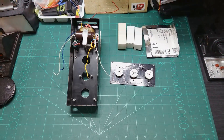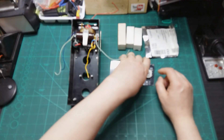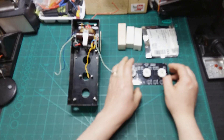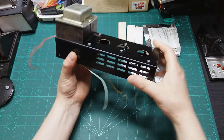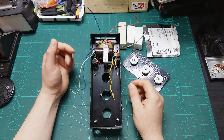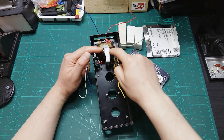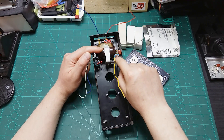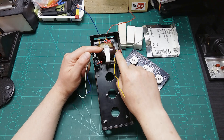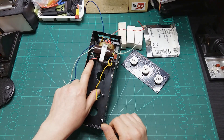Here's what I've done so far: I've soldered the sockets on the PCB board to create this chassis. I've completed the power supply section — the rectifier for the anode, the smoothing capacitor, and the transistor with the zener diode, resistor, and capacitor. There's also another rectifier bridge with the 10,000 microfarad capacitor for the heating element.